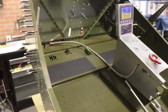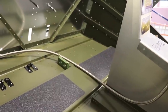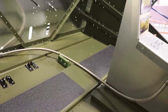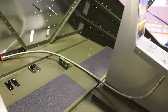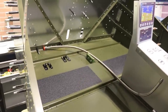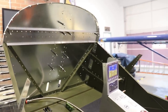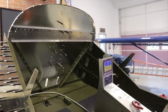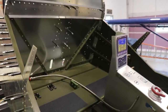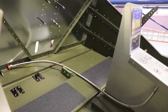Now if I'm going to fly this airplane from the right seat, I'm going to want brakes on the right side. I thought I could add that later, years from now, if I do want to fly from the right seat and provide instruction. But now that I'm already making the panel with dual throttles, this would probably be the easiest time to add brake pedals to the right side.